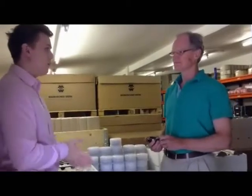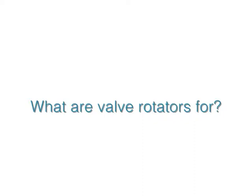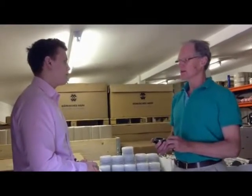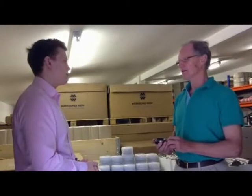Here with me is James Hogg of Zinflex Turbulo, and he's going to tell us a little bit more about these valve rotators. These rotators are an absolutely critical part of the diesel engine. They are there to ensure that the valve rotates. You need to rotate the valve in order to make sure that the temperature around the valve spindle is equally dispersed, and thereby avoiding any early failure of the valve.